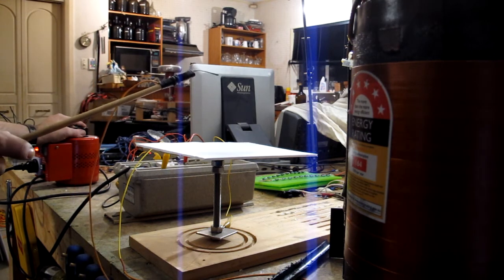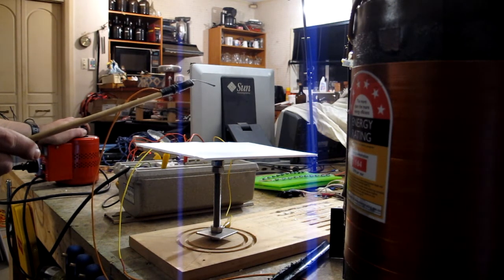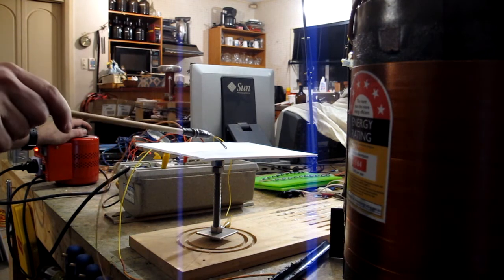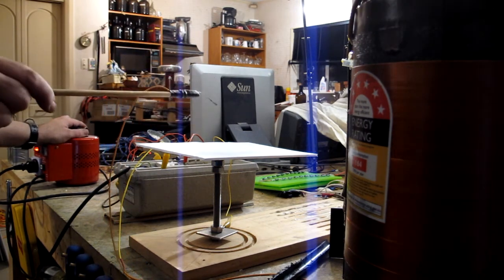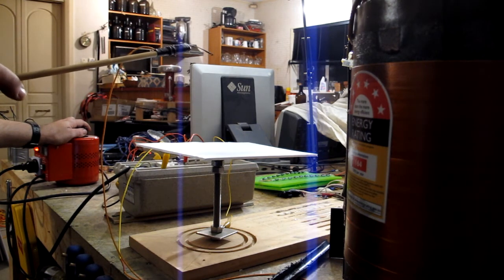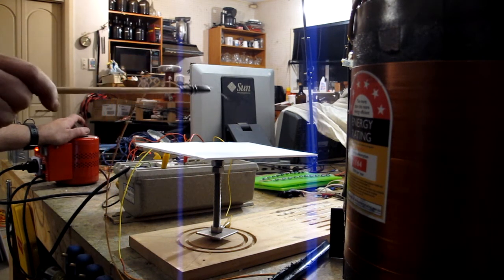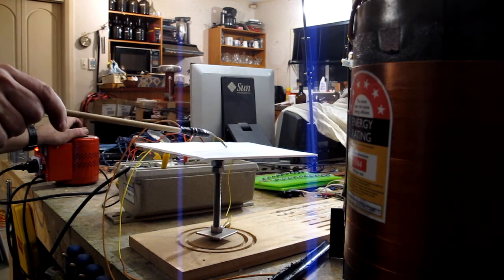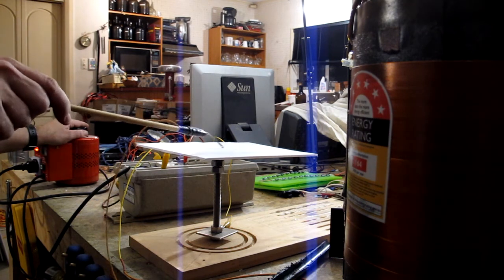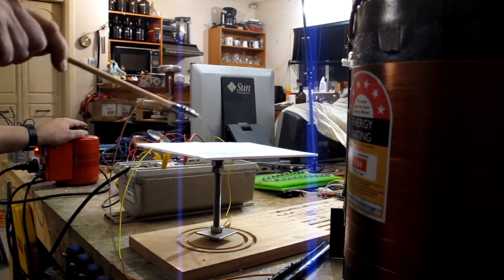So let's find out where it does break down. We've gone to 80, then 96 — that should be about 6,000 volts. I'm starting to hear some corona now, that's at 120 volts in. If we go to 128 — that's a nice multiple of 16 — I can hear it, but still no arcing. That's nice, so that's four times the nominal voltage I'll be giving it — about 8,000 volts — and nothing through the plastic.